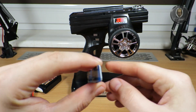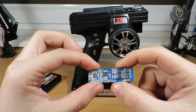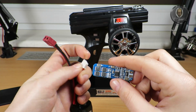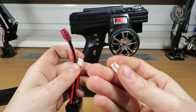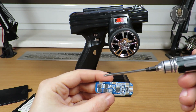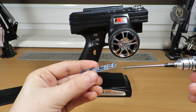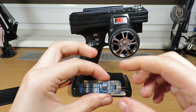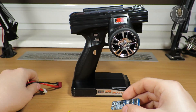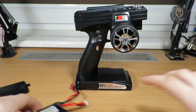Because I will not upgrade the firmware, I will use this - the so-called protection board. It's a 3S balancing, charging, and over-discharge protection board connected to the balance plug. I have an old socket that I will use with some cables to solder it. You connect the battery to the four ports, and there's an output and input because this can also charge, but it needs a one-amp charger. I will not charge it with this - I just need to protect it before I discharge.